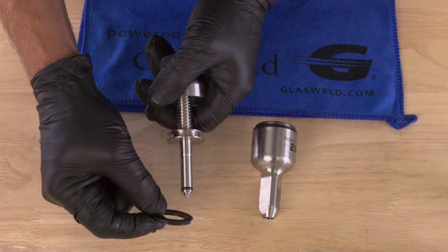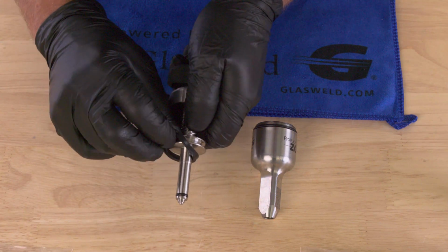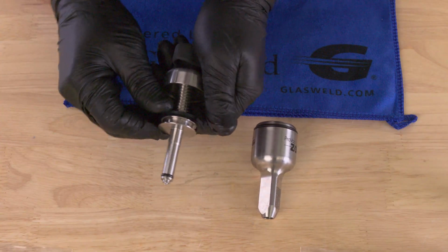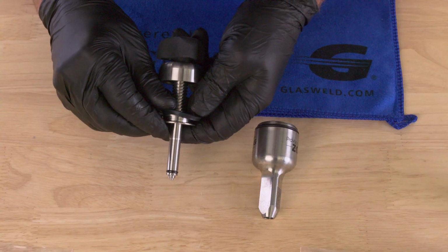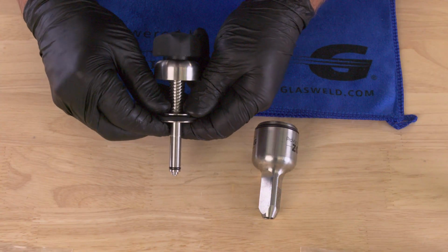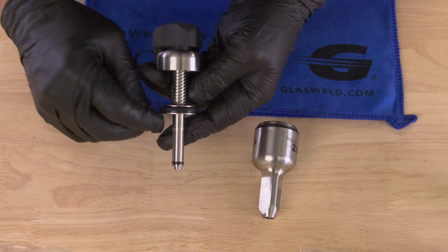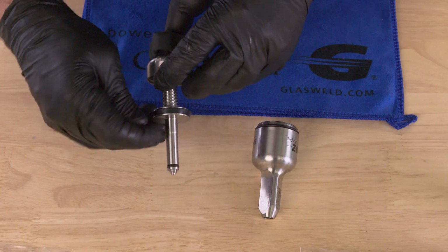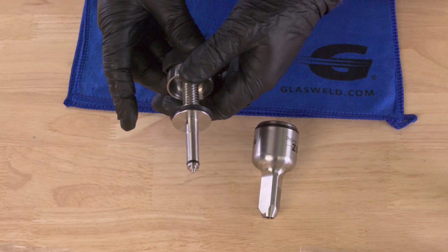Now the easiest way to install these, you're going to slide them right over that lower piston. I like to actually bring it above the area that's meant to hold the seal first, just like so, and then get it in the right direction with that angle facing downward, and then just slide it right over the top, with your thumbs pushing around the edges. Make sure the flange and that groove is still facing up. And now our upper piston seal is fully installed.